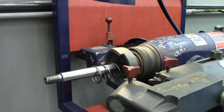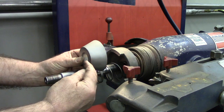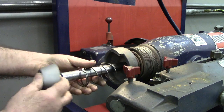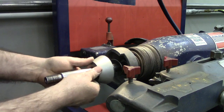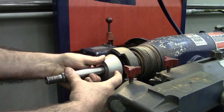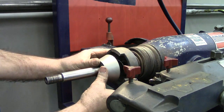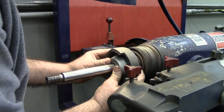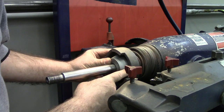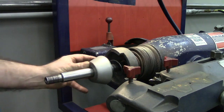First off, we're going to put a spring, and the purpose of that spring is to drive this centering device into the center of the rotor so that it finds the circumference that the rotor actually exists in. And it gives us the ability to do back spacing as we get a different hole versus where the back of this unit is. One thing we do have to watch on assembly, there is such a thing as running this in too far or using too big a one that it bottoms out. And then your rotor sits only on this circle, not on these fingers on the hub above.